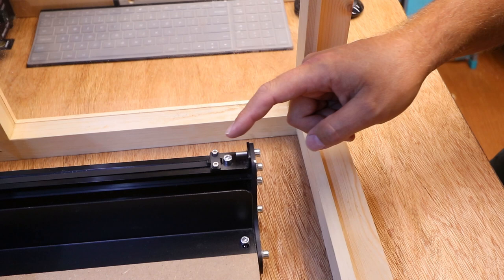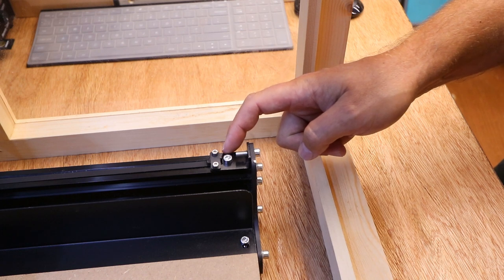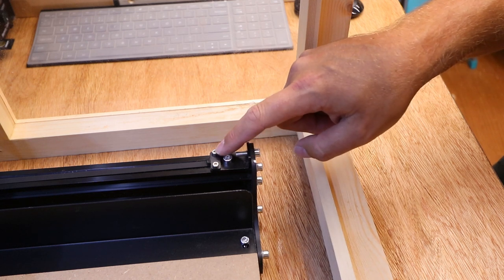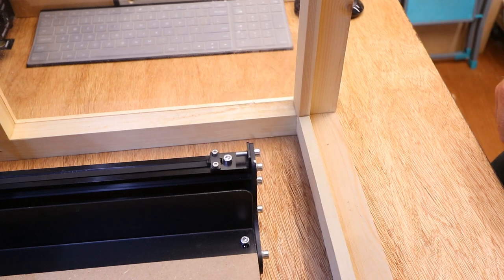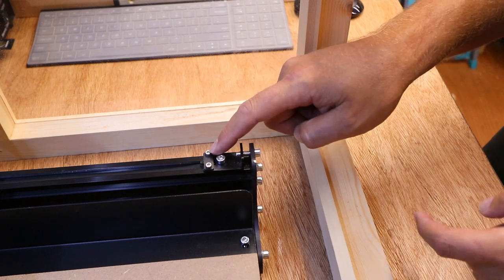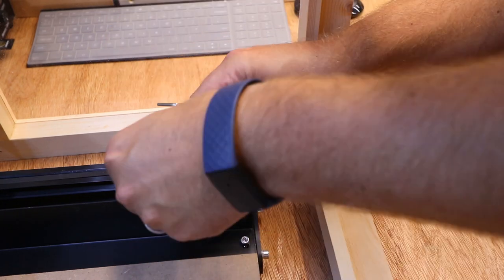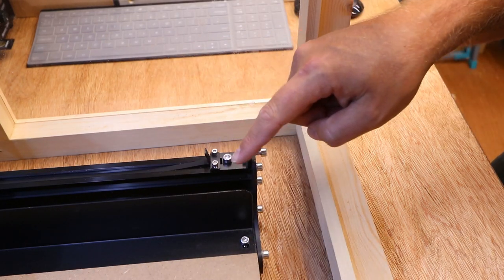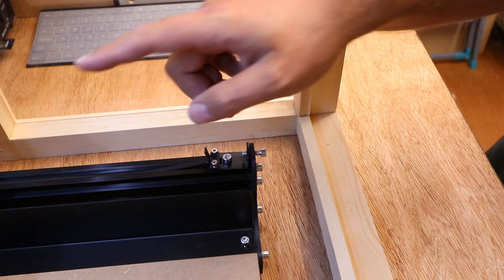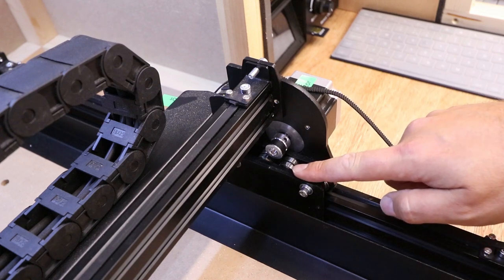Looking at the Y axis, we'll need to release the tension brackets on all four corners to get the belts free. We'll start by releasing the clamping down bracket bolt, then release the tension bolt, and finally release the clamp itself to allow the ribbon to come free. Once we've released the tension it becomes quite loose, and we'll release the clamping plate to take the belt out. I'll fix the clamping plate back down to make sure we don't lose any bolts or parts. With both ends of the belt free, we can pull it out through the carriage and release it completely.